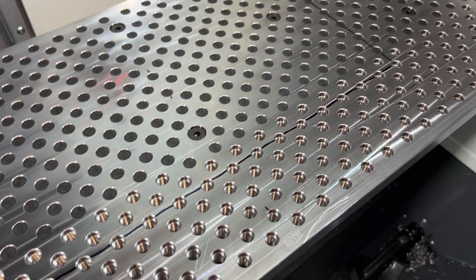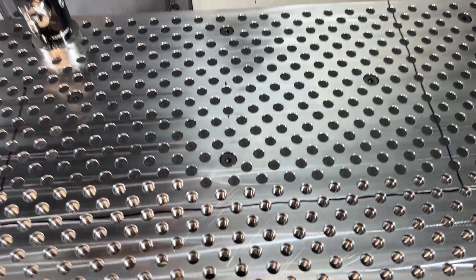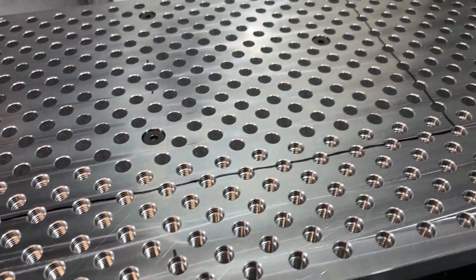One of the challenges is that when you're cutting a large flat part that's close to the maximum work envelope of the machine, a face mill and a lot of other end mills get close to the tool setter and could very easily collide with it. So lo and behold, I saw a video from John over on YouTube — John SL — and he had found this magnetic mount for the Renishaw tool setter by a company called Exact Engineering.